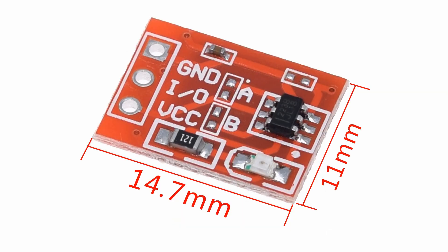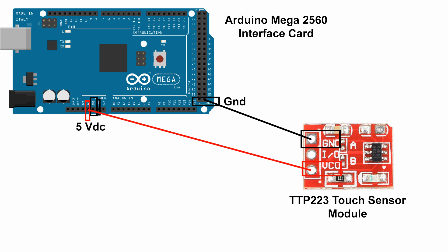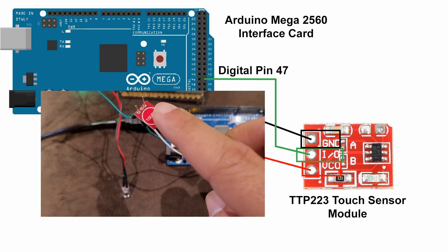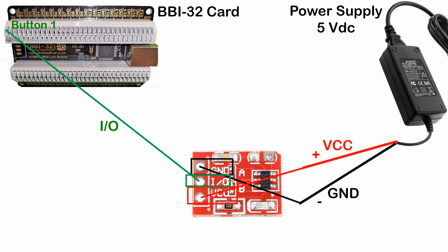For the most basic setup, which would be a push button or toggle switch, we would wire as follows. The VCC pin would go to a 5V power source such as the 5V pin on the Arduino. GND goes to GND, and the I/O pin is the digital pin that will be assigned a function in the Arduino or the HID card. This is the pin that gets turned on and off when your finger touches the sensor. To wire this up to a HID card you would need your own 5V power supply and then proceed to wire as follows.